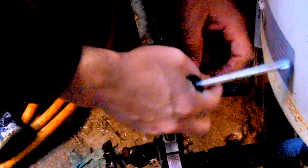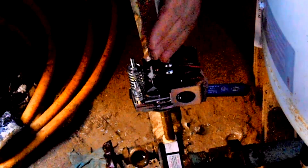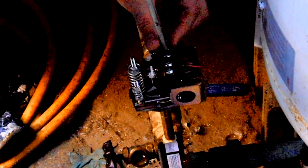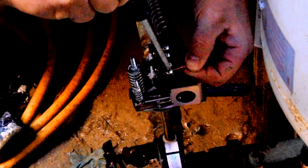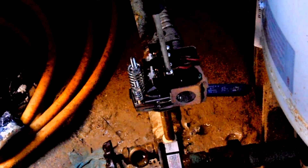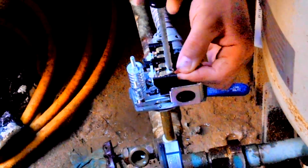If you remember, it was red, black, black, red. We're going to put them on the right side of the screws, because when you turn the screws down they turn this way — you want them to pull the wire in, not push it out. For example, if I plug the wire in on the wrong side, as I'm tightening the screw it's going to want to back that wire out. We don't want that, so we put it in on this side so the screw is gripping and pulling it down.